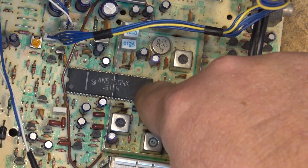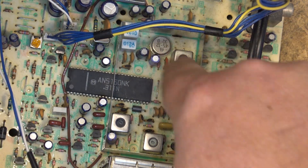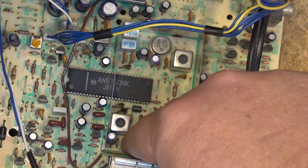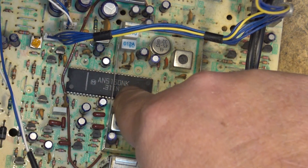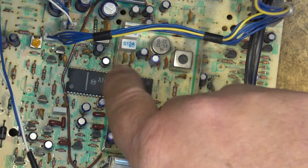There'll be an audio and video input, because I believe the switching is done internal on this IC. Your IF comes in through here - here's your IF transformers, your saw filter. Actually these are probably the IF transformers here; one of these is going to pick off your sound. The demodulation is done in here, as well as the chroma decoding, which is done inside this IC.